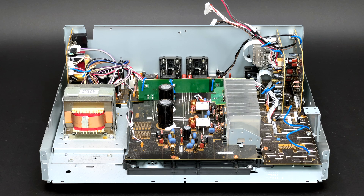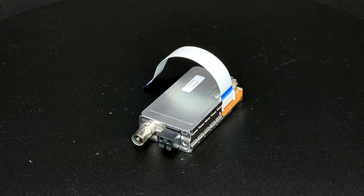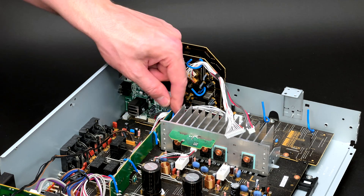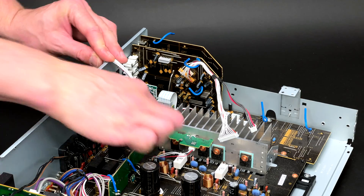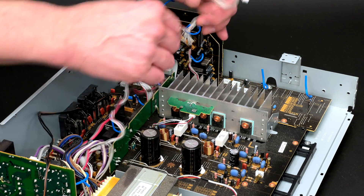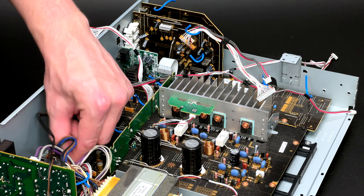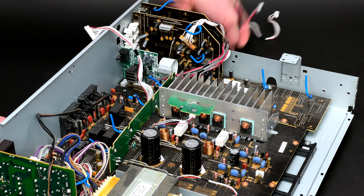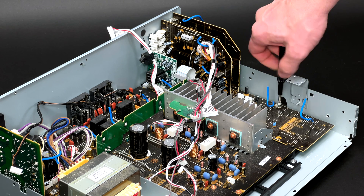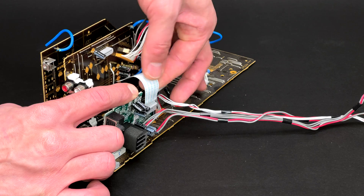According to the service manual, the AM-FM tuner module has to be removed next. After the ribbon cable is disconnected and two screws are removed, the module is successfully extracted. Next step is to remove the assembly of 4 PCBs, but first I have to disconnect the cables — the link between the main PCB and function PCB 1, the cable providing 5V current for function PCB 1, the cable for the dock PCB, and the last cable providing dual polarity 15V for function PCB 1. Seven screws at the rear panel and another two securing it to the chassis are out, and the 4 PCBs can be removed. After disconnecting the ribbon cable, the dock PCB itself can be removed too.